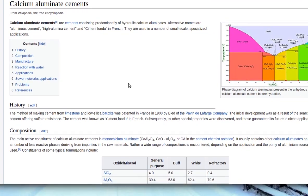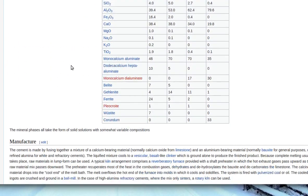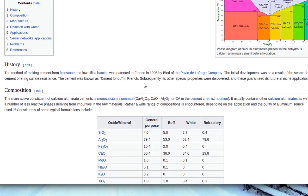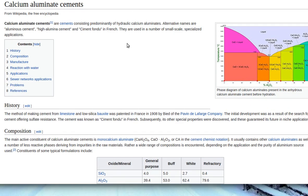It's kind of hard to explain, but I have a video. This is a process that's been around since 1992 — it's called something like shape deposition modeling. Basically, you're putting an entire layer down as a thin rectangular block, subjecting it to a milling operation, and doing that repeatedly to build up layers of calcium aluminate cement. It's a highly accurate mold. Once you have the accurate mold, you fill it with — I was hoping to first try thermoset polyurethane, because they copy the mold almost exactly. If you fill them with carbon-fiber reinforced materials, they're as strong as aluminum. And they're not very expensive — about fifteen dollars a kilogram.